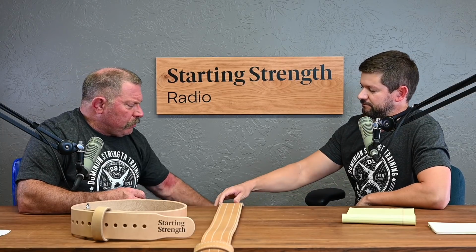Well, you'd have to. So when you take this die, is it a stamp? It is a straight vertical stamp. Vertical stamp. So that would be kind of a problem. You'd almost have to create each hole with a separate process. You'd probably need a stamp that was guided by linear guides on an angle, so that when you put it in the press, it actually slid down and came back up. But it would be an engineering feat to design and build something like that. Nobody does that, right? Not that I know of.